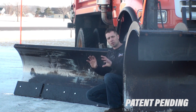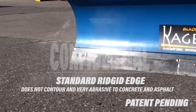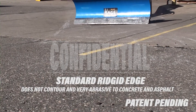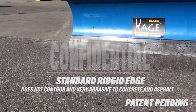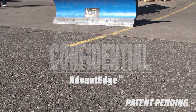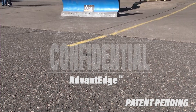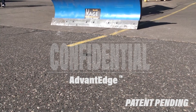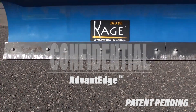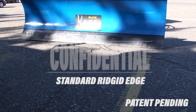What makes this unique is that it's an assembly you bolt on the bottom of the moldboard face, and it's going to allow that edge to flex and follow contours over the ground. It has about an inch and a quarter of travel in each section, and these sections are 24 or 18 inches wide. So as you encounter high spots or dips in the pavement, these sections are going to travel and float along independently of the moldboard.